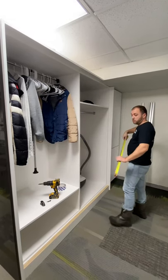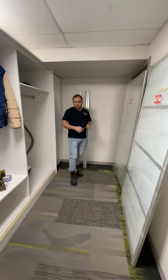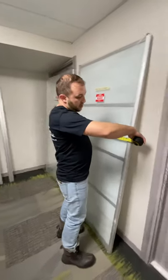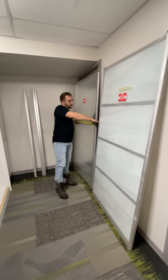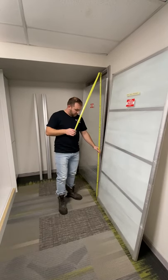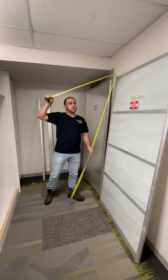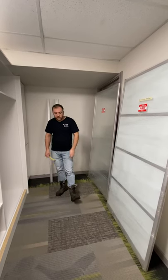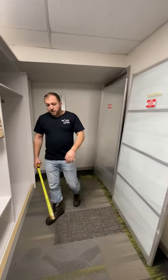The height is 78 and 1/8 inches. In this case it's also not straight, which is fine because all these doors have adjustable wheels on the bottom — we'll adjust them once installed. The door measurement is 37 and a half inches, which sounds good for our opening. The height with the wheel is 77 inches and the opening is 78, so it fits perfectly since the track takes about an inch. The reason you measure before installation is simply because these doors are made to your size, design, and color.